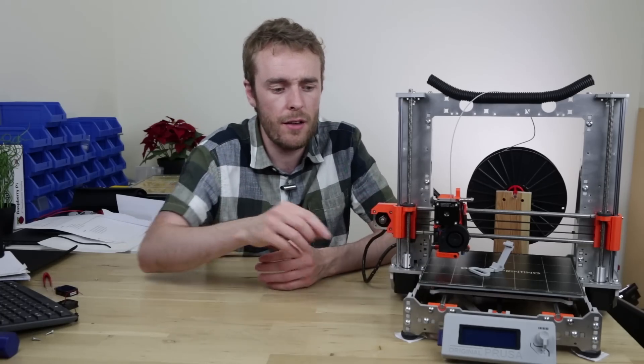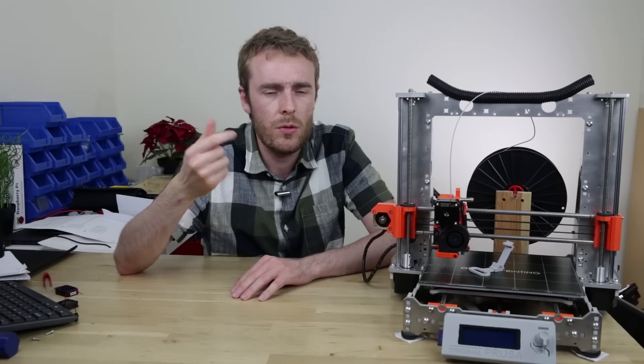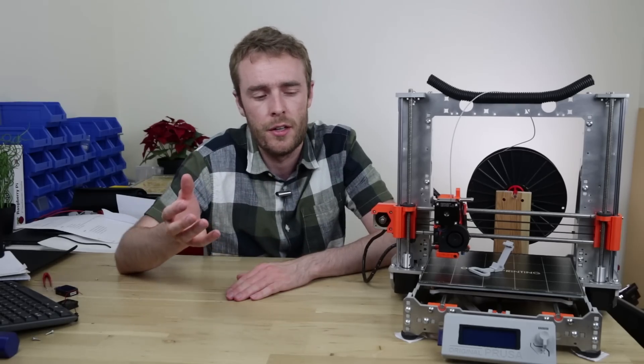The third change is the connection between the LCD screen and the main body. Because the original parts are designed to clip onto the 8mm threaded rod, I needed a slightly different design to fit this frame. I basically cut off the bits that attach to the frame, made it flat, and put some holes through with a little nut holder so I can screw from one side with the nut on the other. I also made a slight adaptation to allow use of LCD screens that have the big variable resistor — the thing that changes the screen brightness. On the original Prusa design it's a tiny little one, but on the cheap ones from China they have this big blue and white one that doesn't fit with the normal clips. So I made a cutout so you can slide it on past the big resistor.